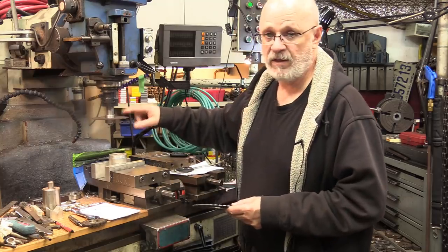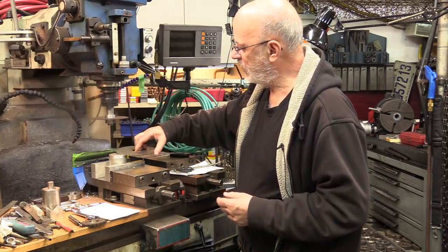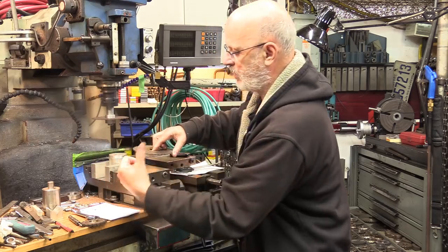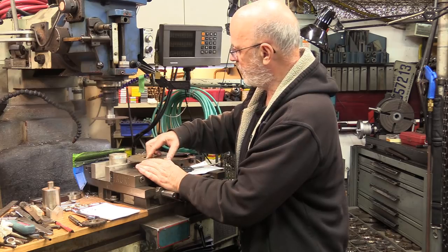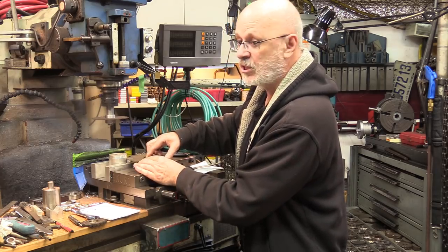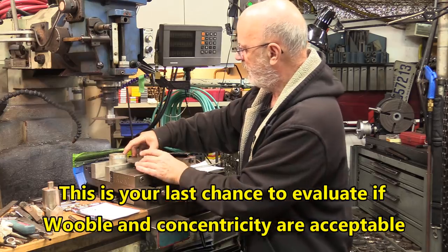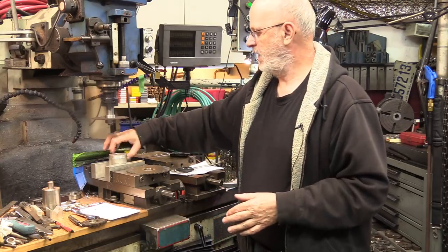As you're going to see in the final video, we're using a five-inch blade exactly this size. We've already calculated the maximum depth we want to go — halfway through the chunk — and we're approaching from this direction using conventional milling, not climb milling. You start by just rubbing a few teeth very slowly towards the blade, which starts scoring. Once you get some scoring, the blade will stabilize vertically. Then go into the regular feed speed and you'll be able to cut the part all at once, giving a very straight cut from beginning to end.